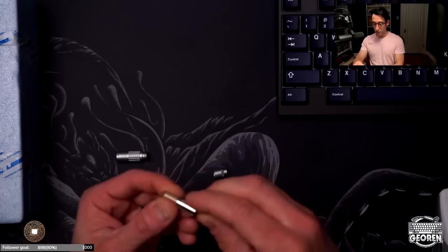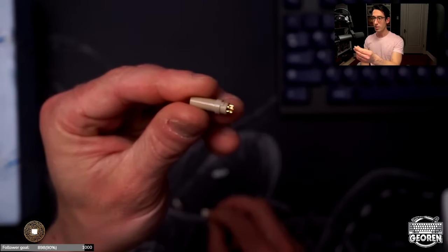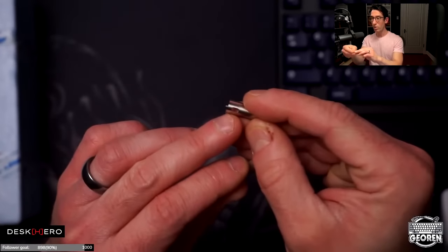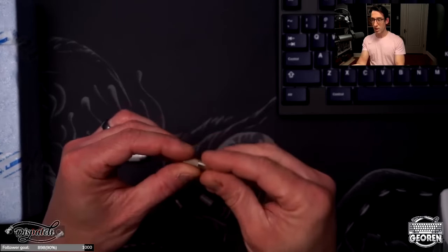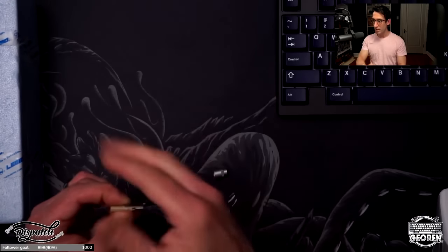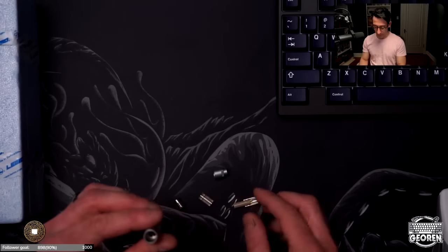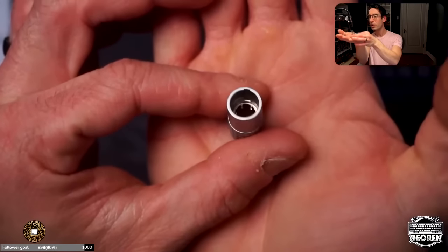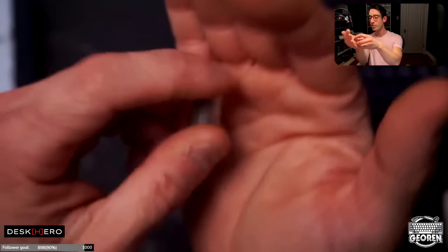Now, this piece here, the shell, connects to the terminals here, the actual solder contact points, via this tab on the front. So this little hole on the top gets put onto the top of the connector, and now this won't turn either. So this locks, that locks, that locks, and then you go. And then this actually goes into the outside. And if you look deep, deep inside here, there's a locking notch there too, which prevents it from spinning around.